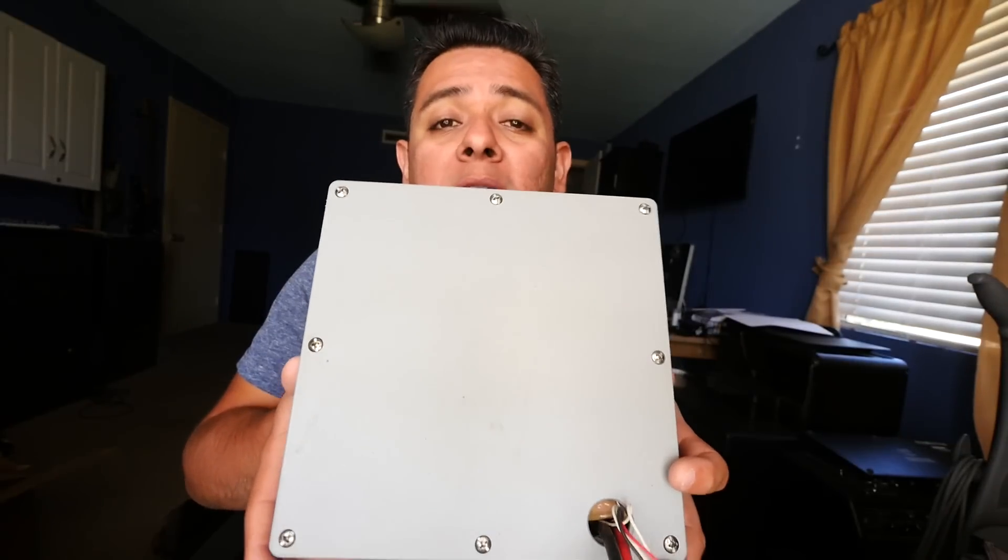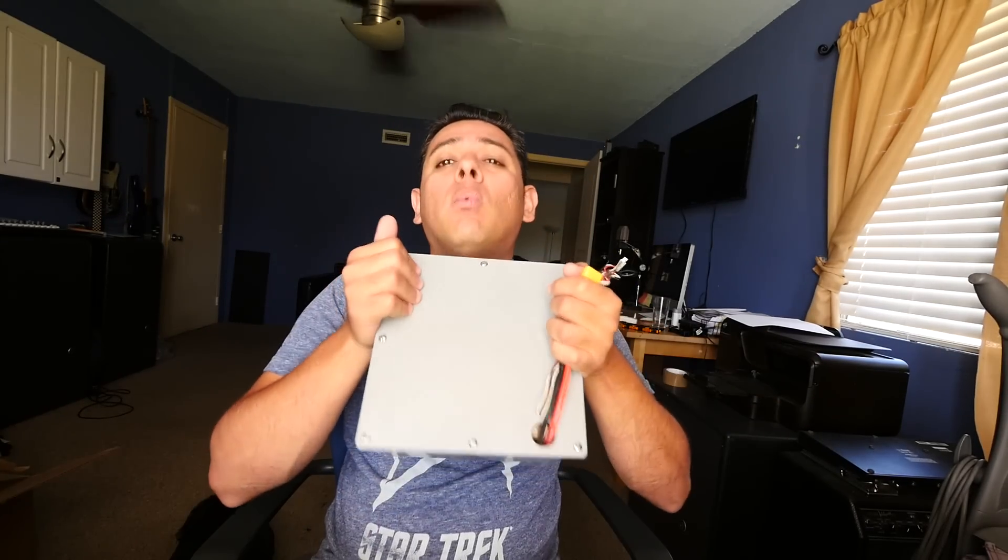One question that will definitely pop up in the comments: how big is my 12-volt battery and what is its capacity? There are 99 cells in here. They're probably about 1.8 amp hours each. So 1.8 amp hours times 3.7 volts nominal equals 6.6 watt hours per cell. Multiply that by 99 and you get 653.4 — so about 650 to 660 watt hours, just over half a kilowatt hour. In amp hours, it's about a 60 amp hour battery.